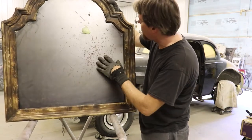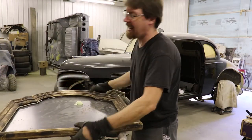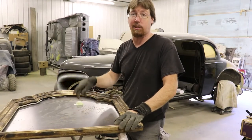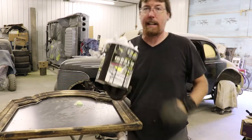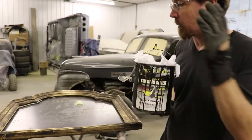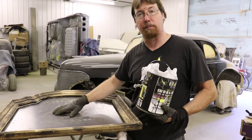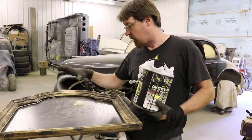What I'm going to do next is sandblast this whole plate and use chassis paint on it. Could you use magnet paint? I don't know — I've got steel. I'm going to do it old school because I'm a steel worker. I don't know if that stuff works or not, but I know this is steel so my magnets are going to stick. So I'm going to get it set up for sandblasting, and once it's done, I'm going to shoot a coat of chassis saver on there. This stuff turns to ceramic — it keeps your metal from rusting. I use it on all my restorations. It sticks really good once the surface is sandblasted, so I'm going to buzz this whole surface down, take this blue coating off, and put a coat of this on there and we'll call our backboard done.